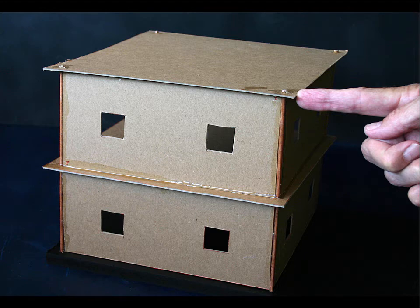Shear walls generally have this sort of punched opening aesthetic, in the sense that if you open up big openings in this wall, it won't act like a shear wall anymore. And a lot of our classical brick construction has this kind of punched aperture aesthetic. Some people find that very unsatisfying because they want lots of glass in the exterior walls.